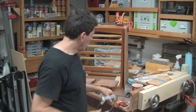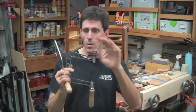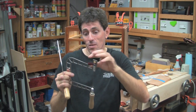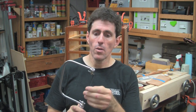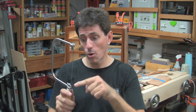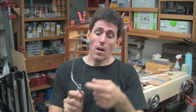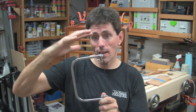In the case of a coping saw, this mechanism here uses a screw to tighten it up rather than a cam action. Coping saw blades aren't scroll saw blades — they're coping saw blades, which are a little longer and have two little pins on the ends that kind of look like Frankenstein. Those pins slide into a slot, and the tension is strictly dictated by how much the metal frame wants to expand and tighten it.